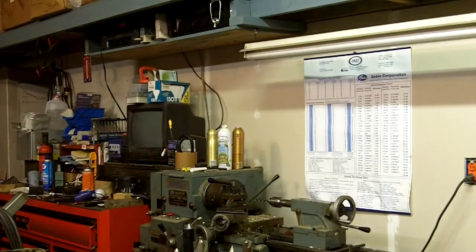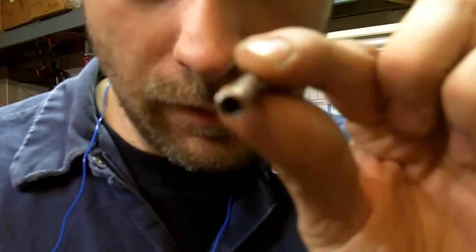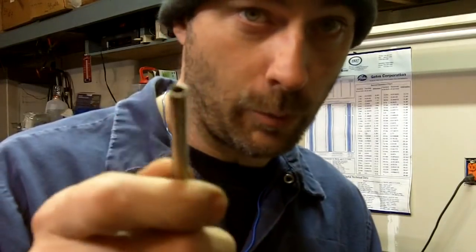And what I did, I took stainless steel tubing and I cut them off to different lengths. And if they're not the right length, I'll sand them smooth. But what I'm going to do is I'm going to drill the holes and then I'm going to ream them. A reamer is a precision tool. A drill bit just puts a sloppy round hole that could be any size through something. But a reamer will put, I don't know if all of you know what a reamer is, but a reamer will put a precision hole in so that this will be a press fit.